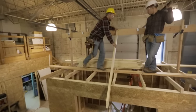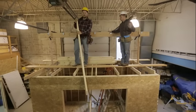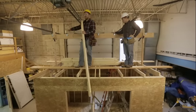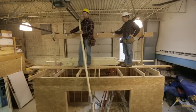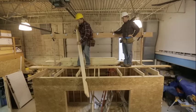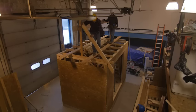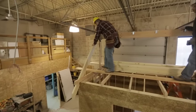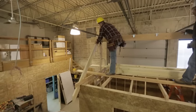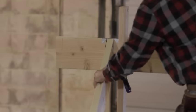I like to install the outside rafters first. We have this ridge beam temporarily in place with quick clamps. Installing the outer two on each end gets the ridge beam pretty much at the right height for all the rest, and we can make final adjustments from there. I'll set this rafter right on the outside, place it in the rafter hanger, make sure the top point is nice and flush, and tack it in place with joist hanger nails.